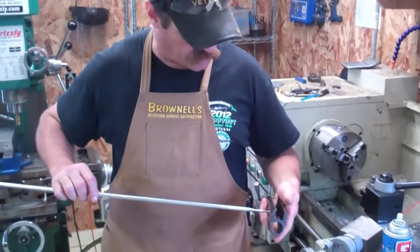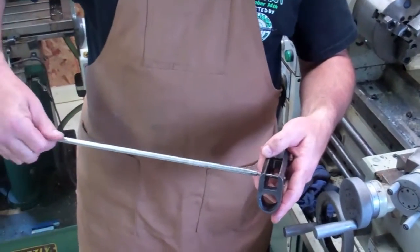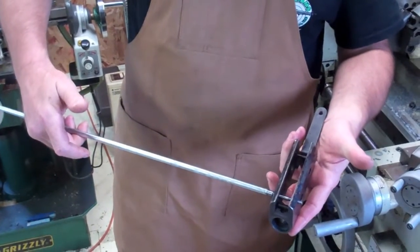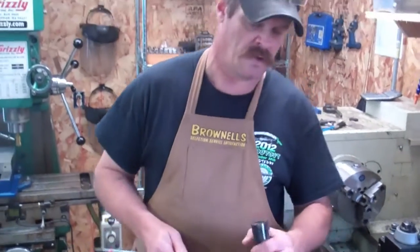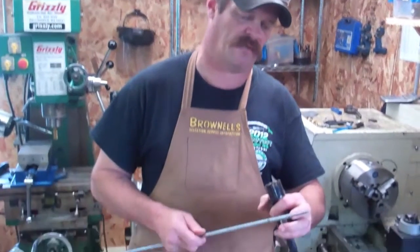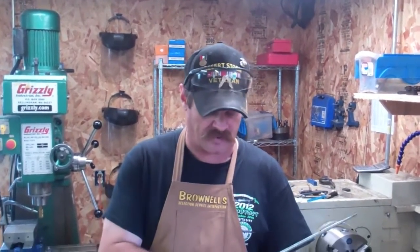So here's our little screw body — let's see how this is going to work. Alright, looks pretty darn good so far. So what we're going to do now is just go cut the screw off. Then I'm going to trim this head length right here with a grinder — just grind it down. I could have got fancy and used a parting tool, but we're making a screw for a non-critical part. I have to make a second one of this same dimension. So let's go ahead and saw this off with a hacksaw, grind the head down, get everything to fit flush, cut a screw slot in the end of it, and then harden and heat treat this screw.